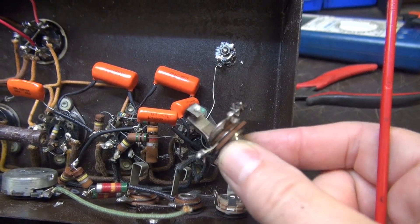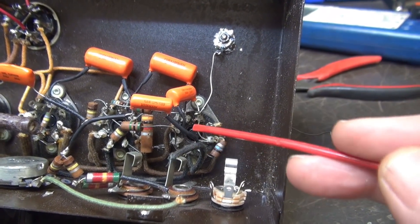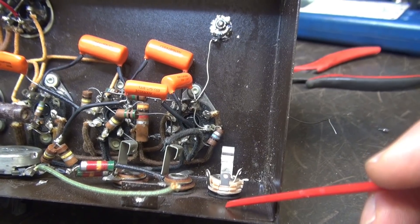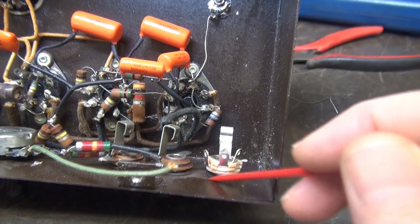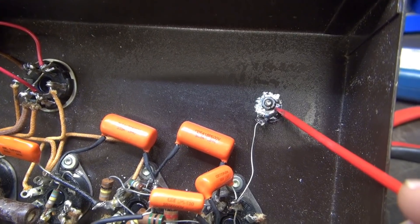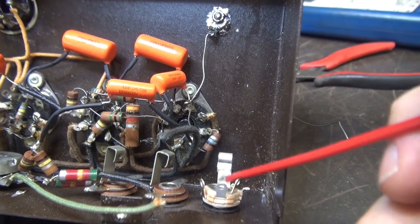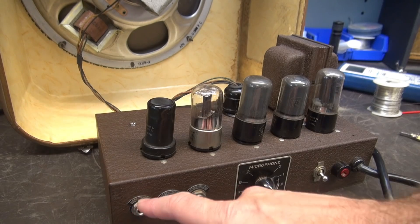Quick update. After removing that old original input jack, I was looking at how they're using a ground lug on that for grounding the preamp tube through this black wire. This cap here was also joined to the same ground lug using the mechanical connection of the jack to provide the ground to the chassis. But when I removed the jack, there was still paint between the lock washer and the chassis — they had never cleaned that surface. So that was a very poor way to ground the input section. I landed a little terminal lug here and soldered it direct to the chassis. The runner now goes over to the preamp tube, I swung that cap over, and now we have no need for this black wire. The input jack will simply have its ground and feed the signal over to the volume pot. I've got the new input jack installed and fixed those grounds.